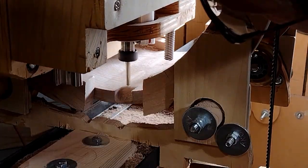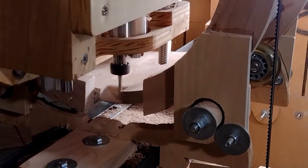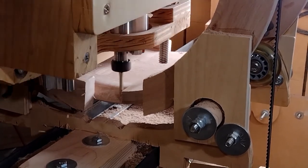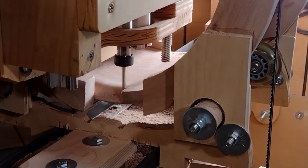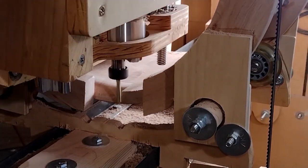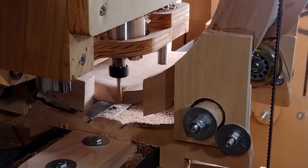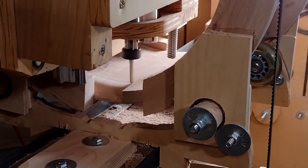Once the inside is skimmed, now I can do the 3D shape on the inside of the drum. You'll notice I'm playing with the height adjustment and also the left side adjustment — it needs to be perfect to line up to the shape of the drum. The toolpath for the left side of the drum took around an hour. The toolpath for the right side took the exact same amount of time since it's the same thing just in reverse. And then the center toolpath to get that concave shape in the middle — that's a little longer yet. So I have probably a total of four hours invested in the 3D shaping of the inside of this drum.